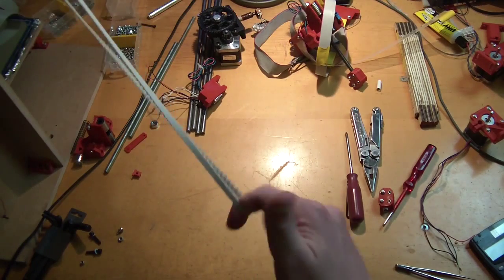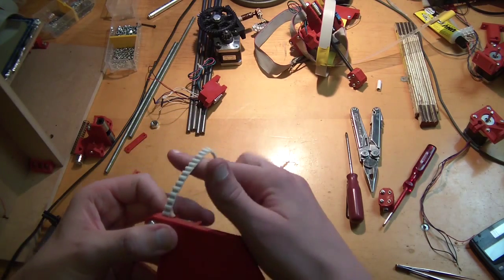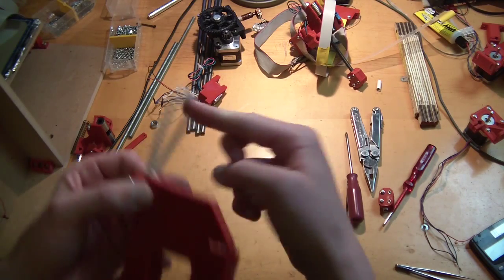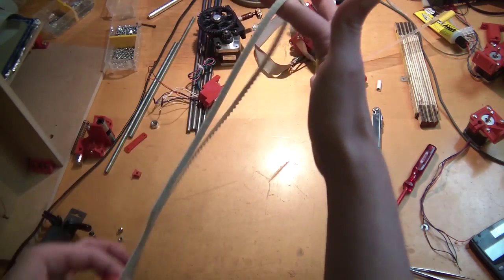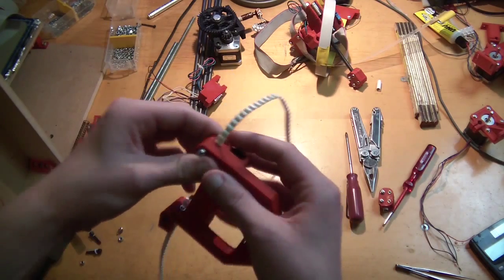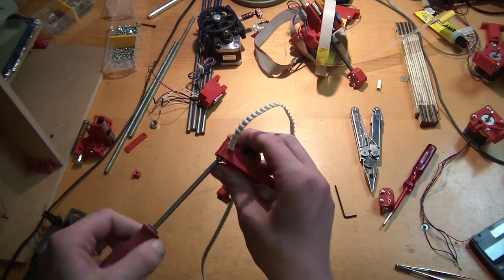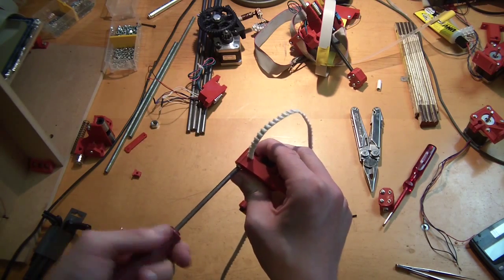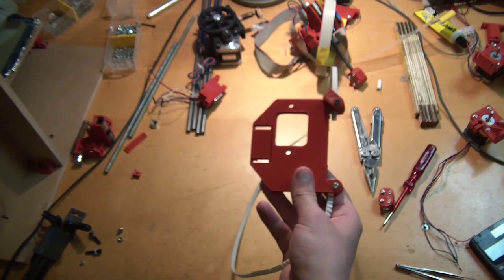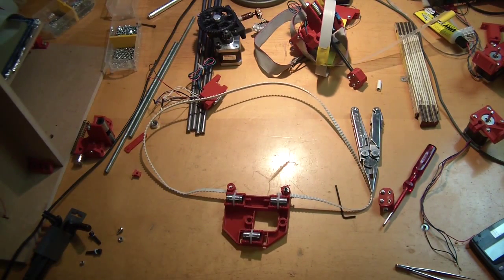Tooth down around your motor pulley, and then it just twists 180 degrees. Then this is where your pulley is, and then you just put it into the hole. If you don't get it perfectly right now, you can wait with inserting the belt until we finish building the X-axis and then it will be apparent what you have to do. So now you fasten this one side — this is in place. You do not have to fasten the other side at all. It's just to have less parts lying around.